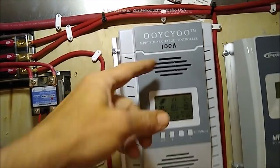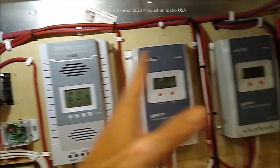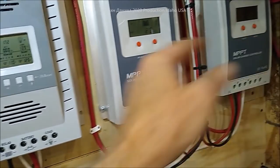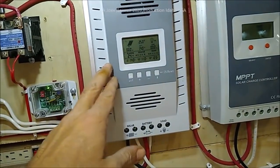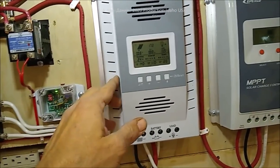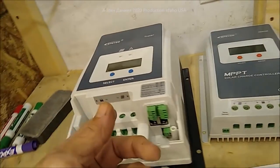Just for aesthetics I want to go all the way up to the 50-amp. I can't put a 40-amp in because these 40-amp units run about 37 amps constant, and this one runs right at 46 to 48 amps constant — so I couldn't put a 40 in. I ordered a 50.